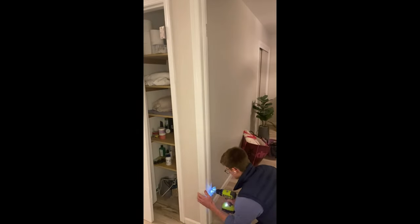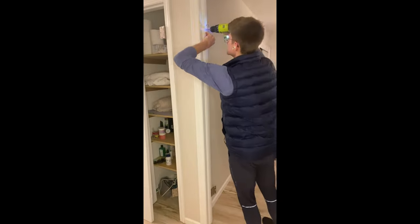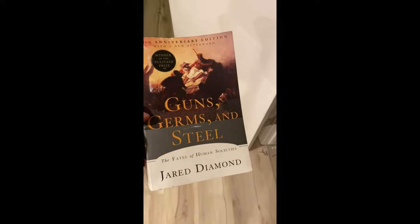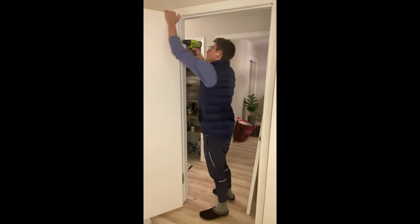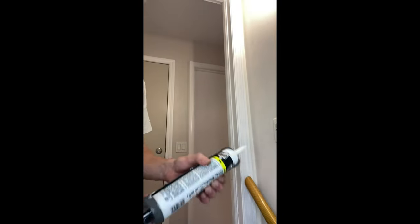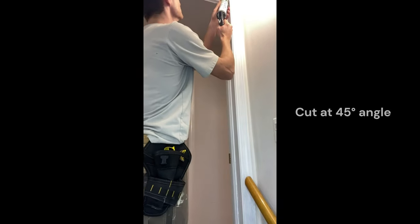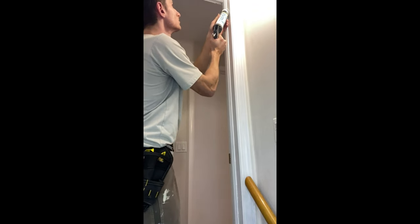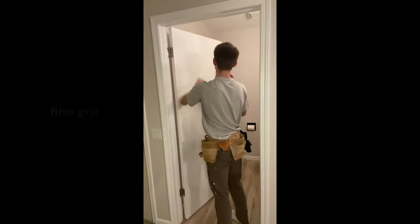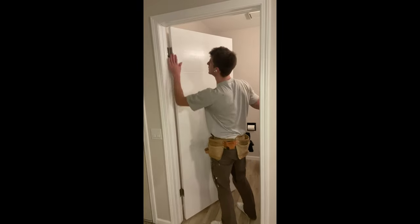So the top coat is finished and it was time to start hanging these bad boys. I started by mounting the hinges first. If you are a one person show, I found that using a book to try and get the door close to the correct height was helpful — I needed to upgrade to a thicker one which happened to be an excellent read. Now we have our first door hanging on hinges. I took a few steps to make the finish look a little less janky. I caulked over some of the gaps in the door frame to make them look cleaner. Cut your caulk at a 45 degree angle so it can flow nicely into your seam and then use your finger after dispensing to smooth it over — such a satisfying activity. I also used fine grit sandpaper to polish up some of the imperfections on the doors, touching up bubbles and nicks with top coat paint afterwards.